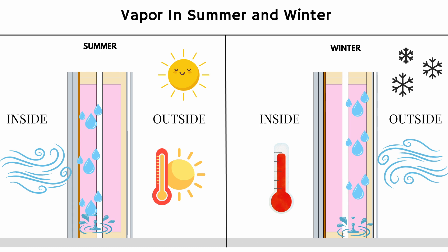In the wintertime, conversely, you're going to have a nice warm, toasty studio with potentially a lot of vapor from exhaling or having people in there, and it's going to be very cold and dry outside. In this scenario, the warm, moist water vapor air is going to travel through the warm walls of your studio and condensate on the cold outside part of your wall, leading to moisture damage and potential mold and mildew growth. So in both cases, we need some way to stop this warm, moist air from traveling through your wall and condensating on the colder part of the structure. This is where the vapor barrier comes in.